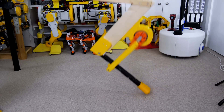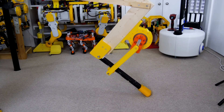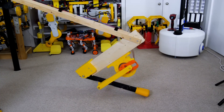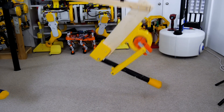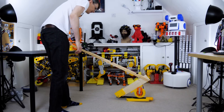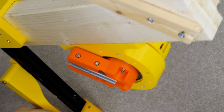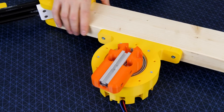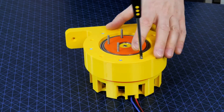If I get the speed just right it seems to work fine — now we can test lots of shocks on that gearbox to see what would happen if it was in a real robot dog. Let's try the motor in the other direction as well. There is quite a bit of mass hitting the ground here due to the gearbox itself and also that massive chunk of wood — a piece of fence post making up the upper leg. A couple of things seem to have broken: not the gearbox, but some thin bits of wood tacked on with wood screws, and a bolt through some plastic making up the crank lever. But the gearbox still seems to be in one piece and running perfectly smoothly.